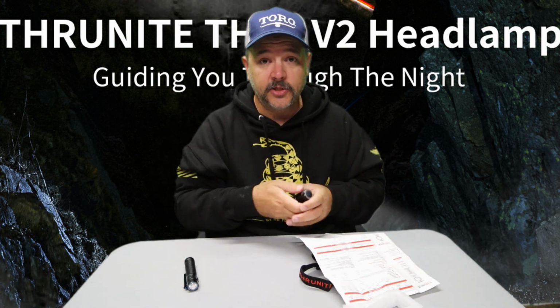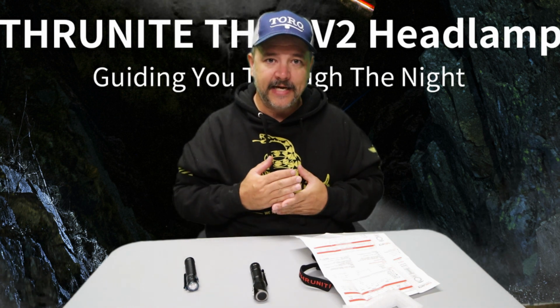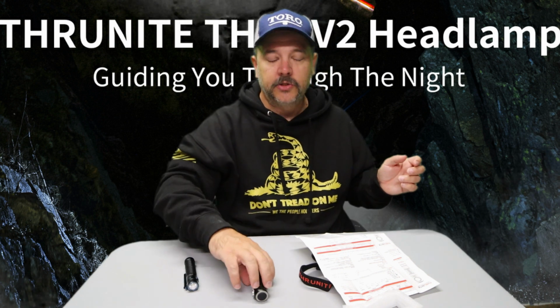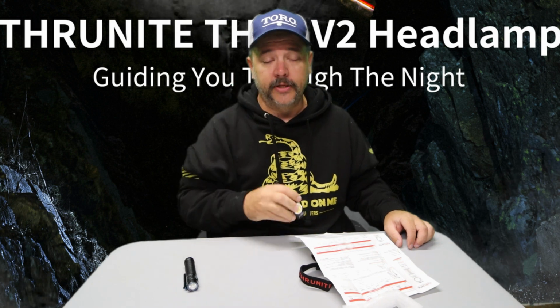Now there again, like I told you earlier, the 18650 batteries, they like to be run all the way down to 3.2 and nothing below that. So my recommendation, if this light is not blue, charge it or replace your battery. Okay, so it's pretty dark out here, and what you see on my hand right there, that's all the light there is out here. And this will be the Firefly mode.